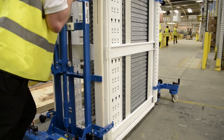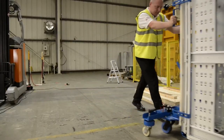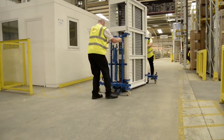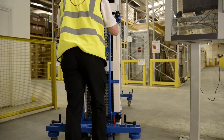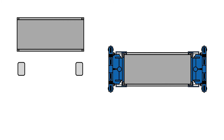Push the load towards the final install destination, being careful to negotiate any obstacles on the way. Warning: avoid negotiating gradients without a prior risk assessment. Once you've arrived at the final install area, make sure the load is immediately in line with the final install position. The data enclosure frame can be installed by either slotting it into a vacant position between existing data enclosures, or it can be installed immediately beside an already sited data enclosure. Installation procedures vary slightly depending on the situation.